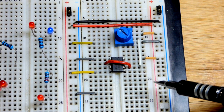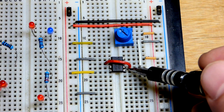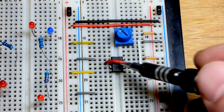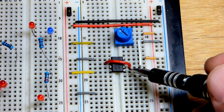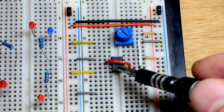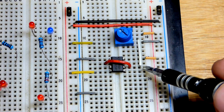And so we're not going to use that in this video right there. So that's pin 7. Now we got 6, the threshold pin. Pin 2, the trigger pin. For this circuit, they're looking at the same voltage right there. And anytime you want it to respond to a voltage, generally speaking, either setting the output high or low, you typically tie those two together, not always.